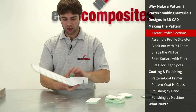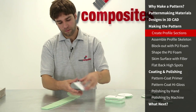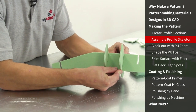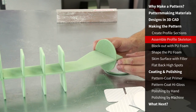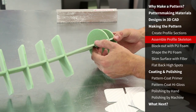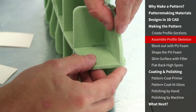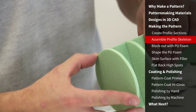With the profiles cut, we can remove our guide templates and look at actually assembling the structure. We have two segments that will slot together and we'll continue to build this like a skeletal frame. You might also want to consider, especially for larger structures, using MDF for making the profiles. These sections we're going to bond on using hot melt glue and then infill to give it more rigidity. The more accurately you assemble your structure at this stage, the easier the job will be later. If you have any misalignments and need to make adjustments, do them now to make sure that everything is as close as it possibly can be.